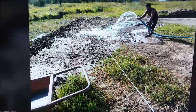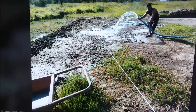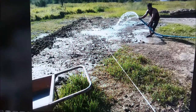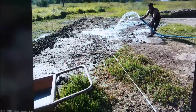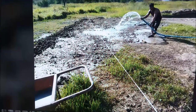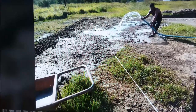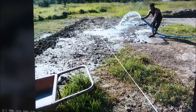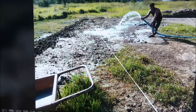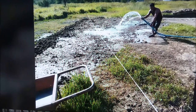It was taking forever to dig. I said go ahead and pour the first four-foot pour on the wall — that way anything that falls in won't end up back in the floor again. When we got the first lift done I said while you've got the forms down there, just pick them straight up and pour the second lift. At that point there was no reason not to pour the third lift — another three and a half feet. Then I think we put 14 inches on top of that. Then when they said we want to dig that dirt now, I said no — he's already got four or five inches of water down there. We still have a slab way down in the ground we'd dug up for the tilapia tank, and that's about 29,000 gallons. So we never got back and all of a sudden we had nine feet of water in the cistern. If he takes the water out, that's something we can do when the weather dries more.